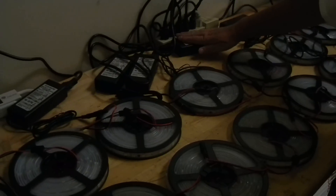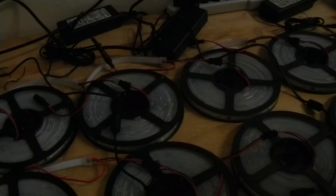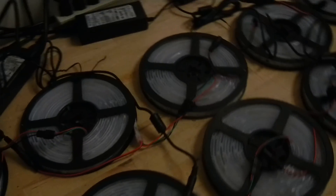You're welcome to do it this way. The reason we have so many power supplies is these are six-amp supplies — you want enough power so you're not overworking them. These power supplies right now are just warm to the touch, not hot. If you get a power supply that's getting really hot, you're overworking it and eventually it's going to burn out. So either do it this way, or get a power supply that's big enough — talk to your electrician about what size you need.